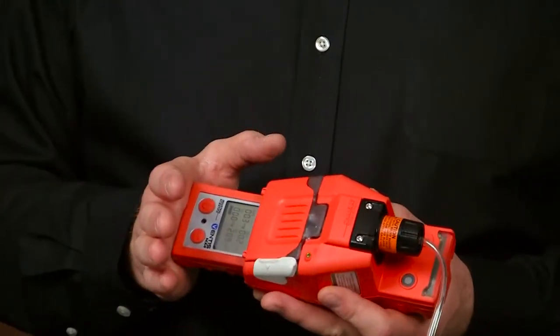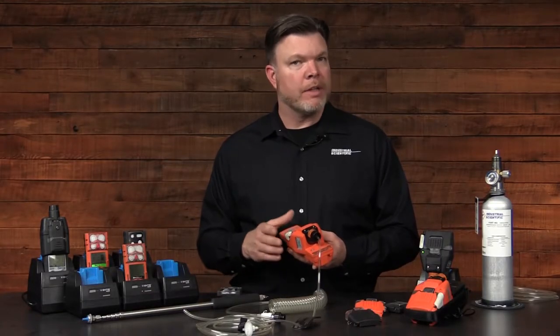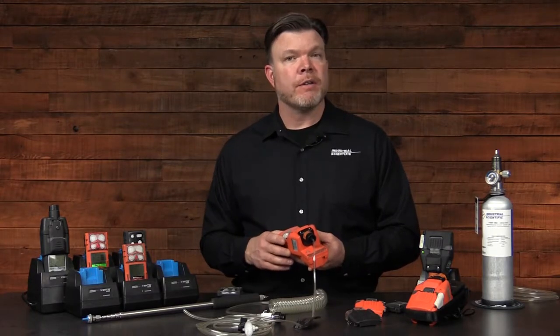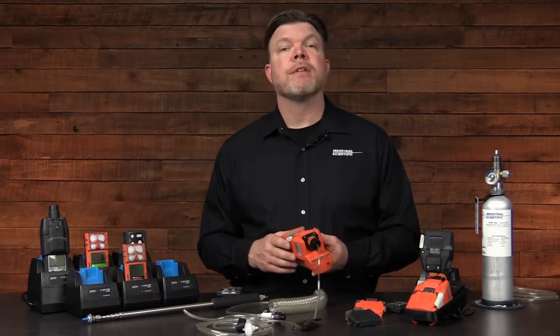The Diffusion Ventus is now a sampling instrument. The Ventus slide-on pump is capable of pulling a distance of 50 feet, which is fine for the accessories here in this demonstration. But if I needed to sample a distance greater than 50 feet, I would need to go to an instrument with an installed pump.